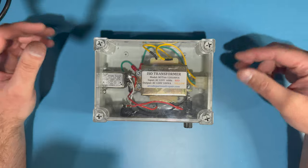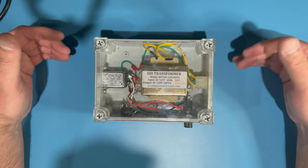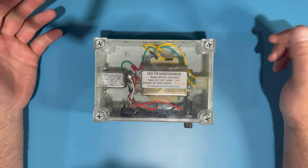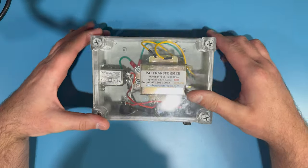You can't just hook it up directly to a power supply or directly to main power coming from the wall. It has to go through an isolation transformer for safety reasons. If you don't do that, you'll blow the bridge rectifier and lots of other bad things will happen. Typically what I've done in the past is drag an entire cabinet over to tap into the isolation transformer, typically in the bottom of the cabinet in that suitcase brick setup.